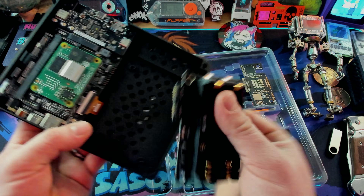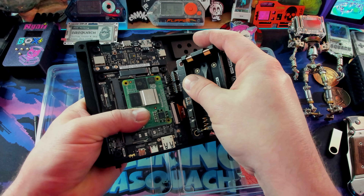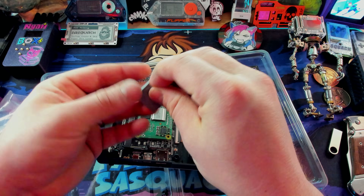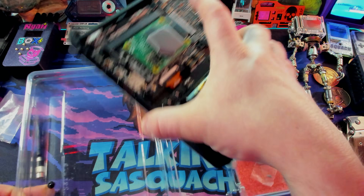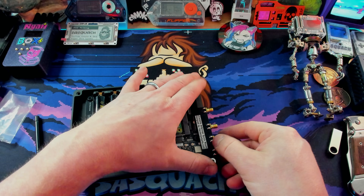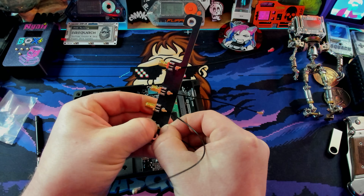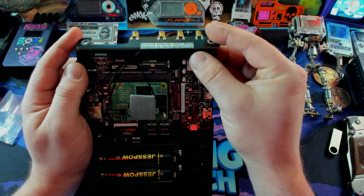Now we go ahead and pop on the battery board — you've got to kind of jam it in there. It's a little finicky because it's got a weird connector, but if you don't get it in there hard enough you're going to have connectivity issues. Obviously we need some batteries — plus goes this way. Pull the protective layers off the thermal compound and pop that right down there. Move this over and hook up our antennas. This is the antenna board and it kind of just squishes into the top of this. It's a really good design. Start popping our wires in — these connectors are hard to connect, but we'll get them working. The further away ones have longer wires, and all of these route through that little hole right there.